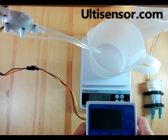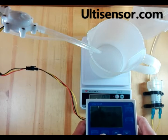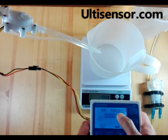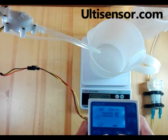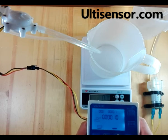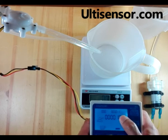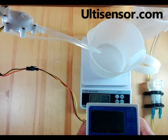The second step is to set the dosage value. Press set and the number on the first line will blink. Press up and down to adjust the value. The dosage value is 0.1 liter, that is 100 grams.